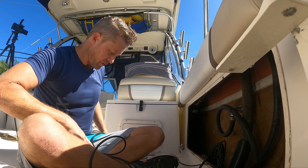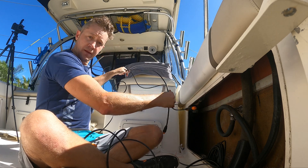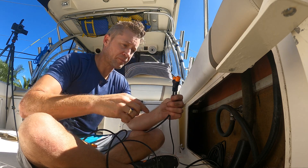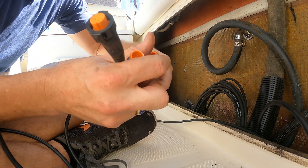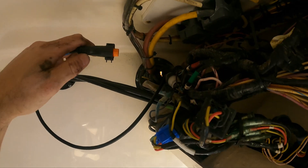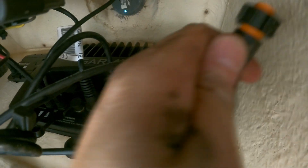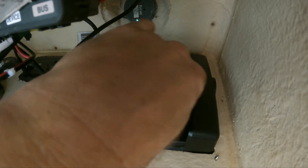Right here is where I'm going to connect my two cables from my port and starboard transducers to the Y-cable that Garmin supplies, to convert it into a single port entry in the MFD. The collars simply snap around — port side transducer, starboard side transducer — mate them together and screw it down, and that's it. This is the last stage: I've passed the cable up through this point, there's our MFD, here's my 12-pin port, and that plugs straight in. We're installed.